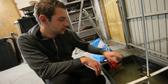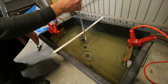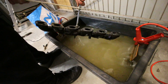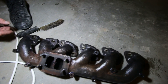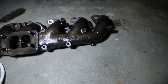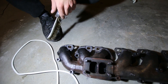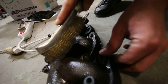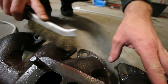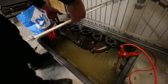So we just disconnected the power and we're going to see what is done. I'm very curious to see how it looks so far — it's been about two hours. At about two hours in you can already see that it's working really well. This has all become black — all the runners are already black. You can still see a lot of rust here, but now after two hours we're just going to go over it with a brass brush and then put it back in for a few hours and see what happens.